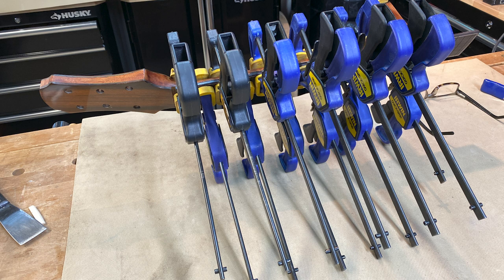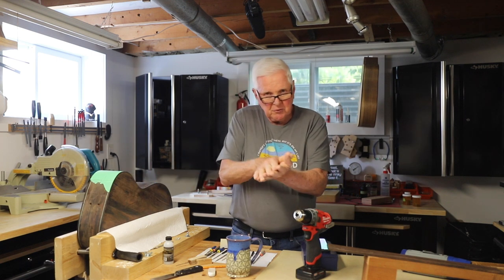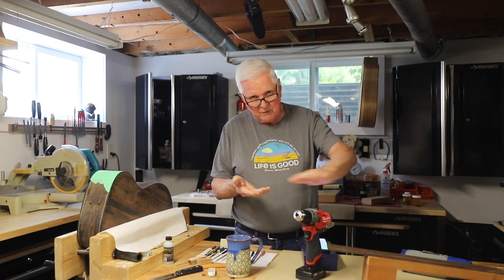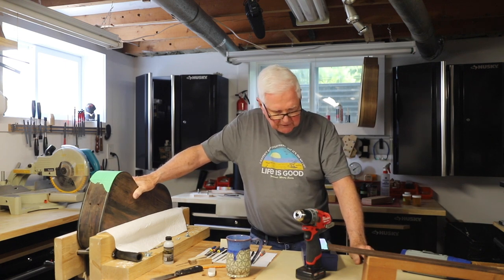Now the neck here — you'll see in this next picture I've clamped the fretboard on, I've glued it. I had some help with this just because of my shaking hands; I wanted to make sure I got this perfect so I could feel it on the sides, and we were able to clamp it into place. I left those clamps in place for quite some time. So the new truss rod is in and the fingerboard's back on the neck, and the sides are fine. I would sand those down again to treat them up again with the French polish, which was not a big deal.